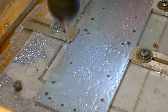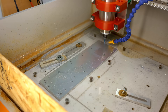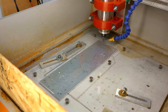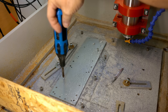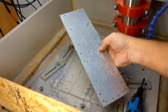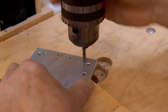Based on the comments I've gotten on the previous videos I should point out that this CNC you're watching is one I made myself as well. This one works exactly the same as the new one will in that I'll be taking very light cuts and lots of passes to cut through the metal — trading speed for economy. That was a consideration from the very start on both builds in deciding how stiff they need to be and how much I wanted to spend. A CNC that cuts more aggressively would have to be a lot stiffer, a lot more rigid, and ultimately costs more, and that's something that happens in every project when you're building things that work in the real world.